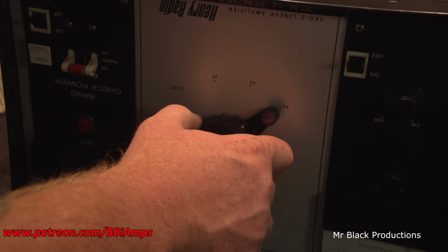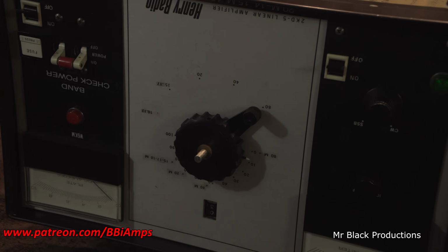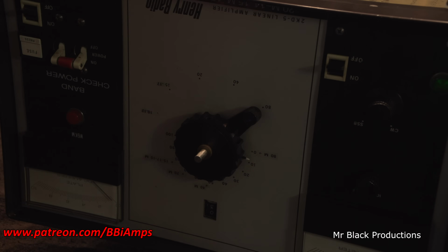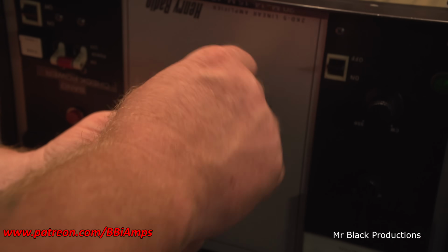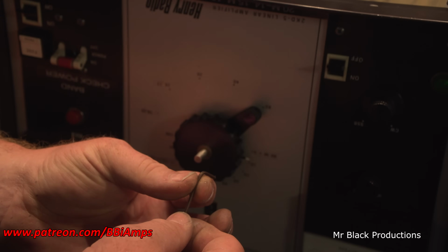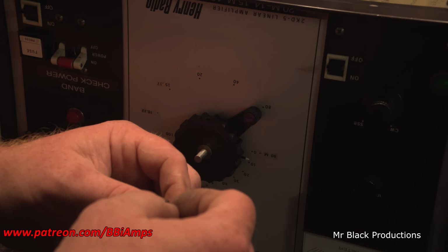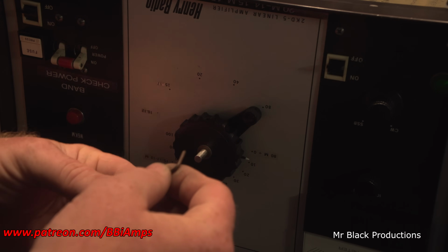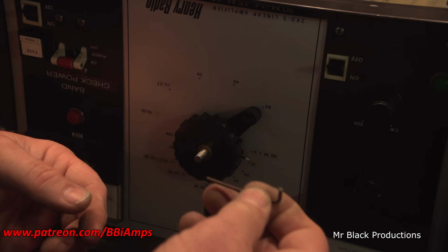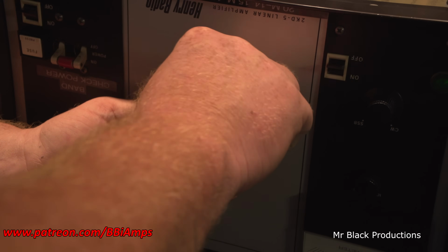And then I had the big long conversation like it was new, and I'm going to mention it again because you never know where you're going to catch somebody. I've mentioned this in many other videos before. This is Henry, you guys. So they use their own hardware, their own keys. This is called a Bristol key. This has, let's see, 1, 2, 3, 4, 5, 6. Six-sided key. All the edges are very sharp and they're not tapered, so they kind of suck to work with a little bit, but we want to index that for 0.